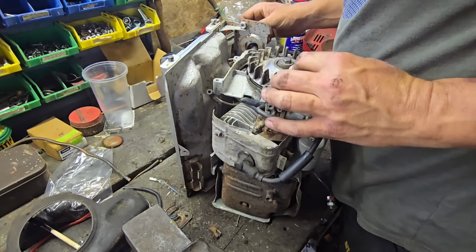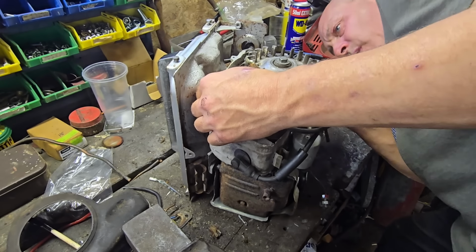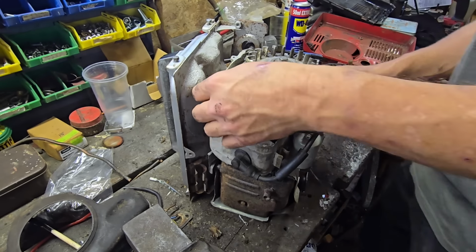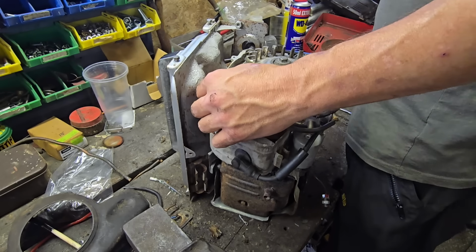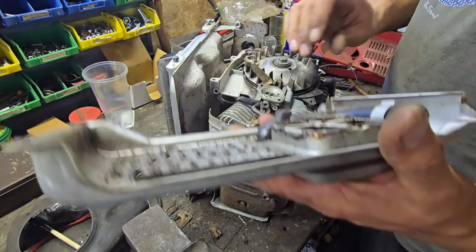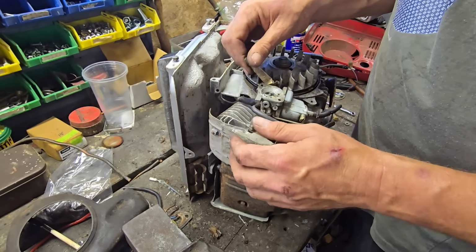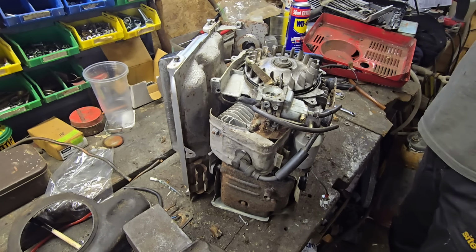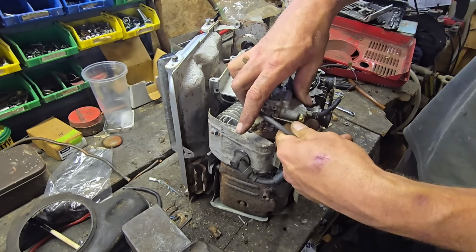Right, never mind. We have an on and off. Doesn't look like that. Oh, right, I see. This pipe here, that's the crankcase breather. That one goes into the crankcase. This one looks like it's a drain out of the petrol tap. Right, okay. Oh, of course it is. That's going to go on to the back. Probably. That probably fits in here, look. That's a breather pipe that goes back in there. Right, okay. I'm going to mess around and try and get this carburetor off. And then we'll be back. I shan't film that. Saying that, that looked like we can just take the bowl off.